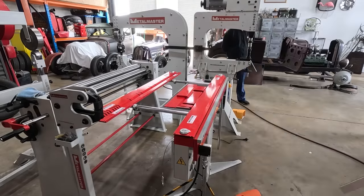So I'm not sure if I'm gonna flatten this flange out again, put the stretch back in it, and then not use the shrinker until we've got that edge turned. I think that's what I'm gonna end up doing. So right now I'm trying to just kind of reverse a mistake. I'll probably try stretching out this again. I might have to knock it flat, like I said, and then hopefully we can turn that flange into it and continue as I originally expected. I wanna turn the flange in and then make the profile die so we can knock that in. So that's what I'm gonna get going.